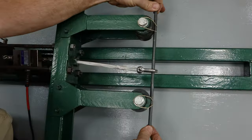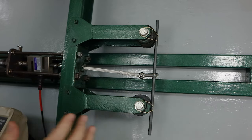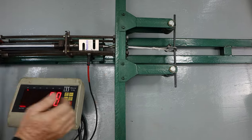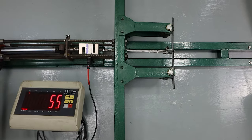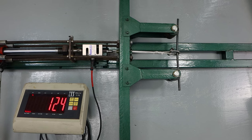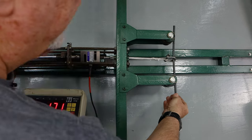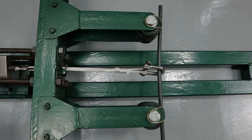I've got plenty of our standard steel so I'll start the test. I had it up to 110 kilos already; I'm going to take it up to 120 and then check for straightness. As you can see when I rotate it, it is already perfectly straight. Let's give it some load — we're up to 55, taking it up. There is 120. As you can see, fairly well flexed. I'm going to back it off.